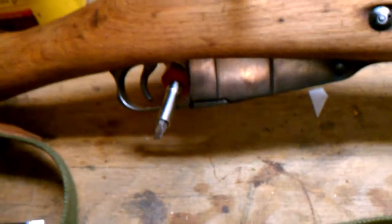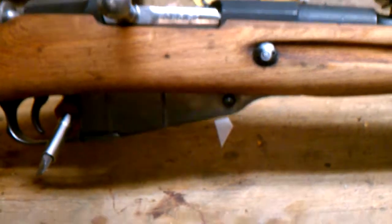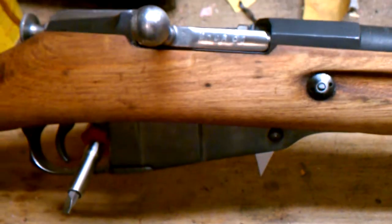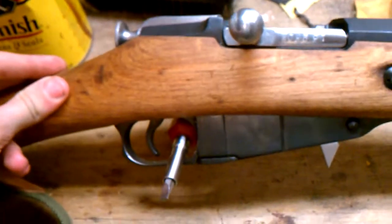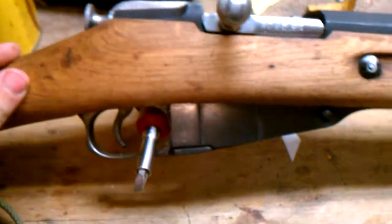soak the paper towel, and let it sit in a very, very ventilated area. Cannot stress that enough. It has to be very ventilated, like outside on a hot day. That'd be perfect. What it'll do is it grabs the cosmoline and it pushes it to the surface, and when you take off those paper towels, they will be brown. I'm telling you, they are going to be brown.